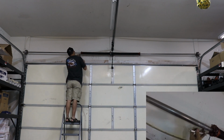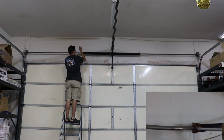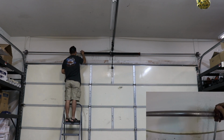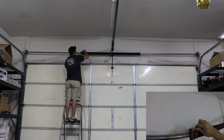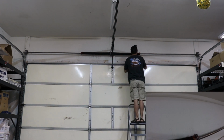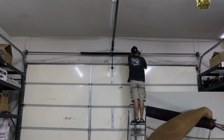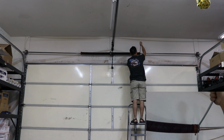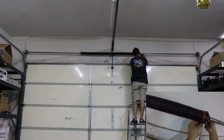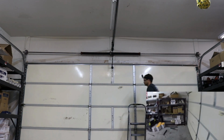Lock the bar in place, resting it on the upper ledge, loosening the square bolts. 1, 2, 3. Yeah, so I did do 27 the first time, so now we're at 30. Both sides get equal tension. And you don't want to over tighten these things. What I read is you want them to contact and do another quarter turn. I did a little more than that.